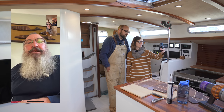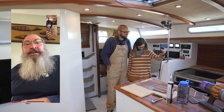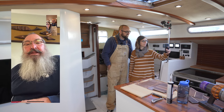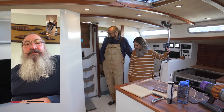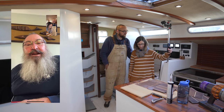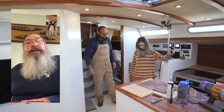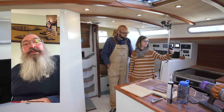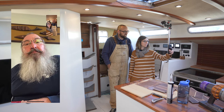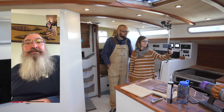It's a little different working on a boat as opposed to a home or a business. But for your job, I would think when you're coming through the doorway there, you're down on the floor, you're looking at the refrigerator. I'd like to see it balanced around the refrigerator, and see how it lays going into the walls. Okay. Providing you have a small filler for the walls, you try to keep those at least half the size of a board. Okay. Would be a good look.